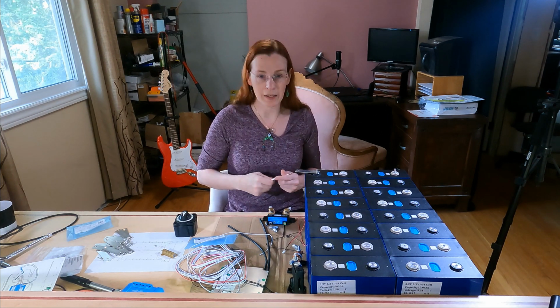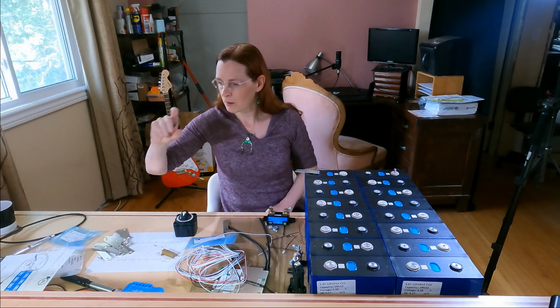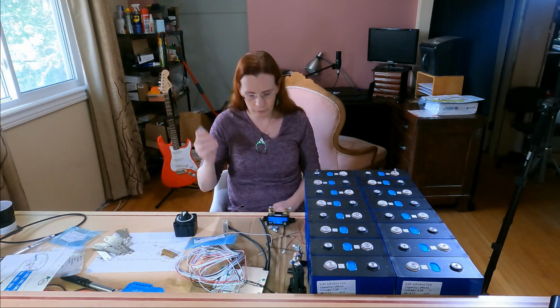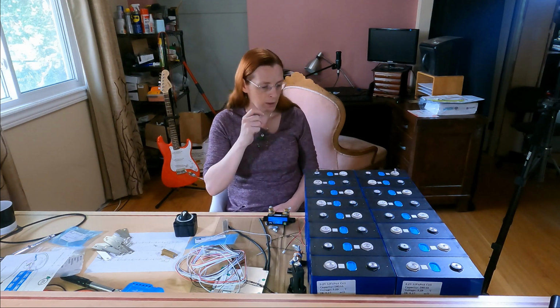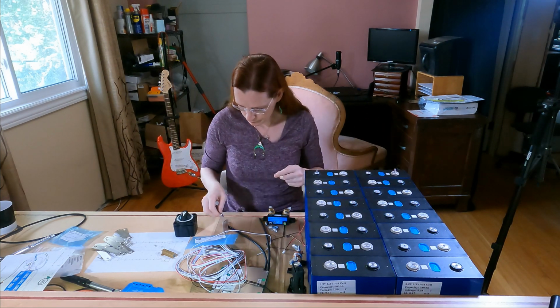So for now, because it's simple, I'm going to drill a hole through this, and then I'm just going to run a bolt and a nut through the middle of the bus bar and run the lead off that way. I need screws and bolts that are going to fit this properly. It'll be ugly, but again, this is my test battery. This is me learning how to do this. Everything's going to be torn apart and reworked whenever I finally get a boat.